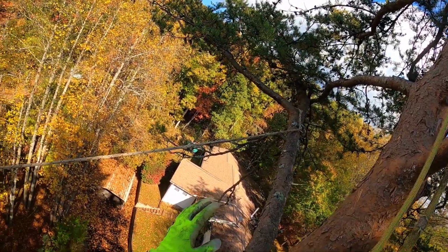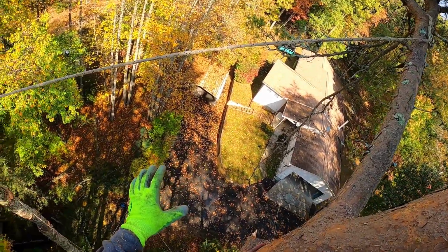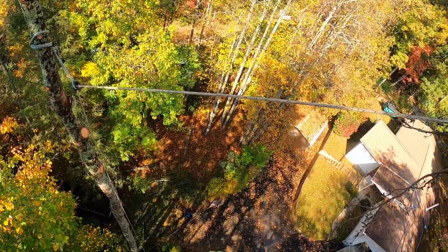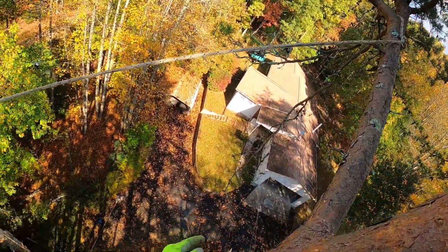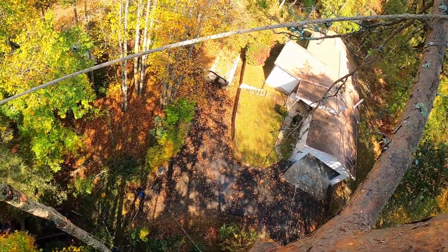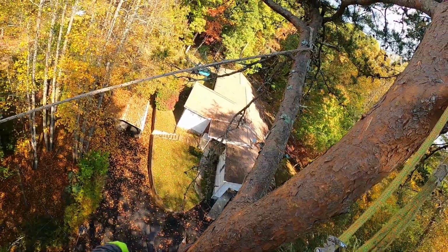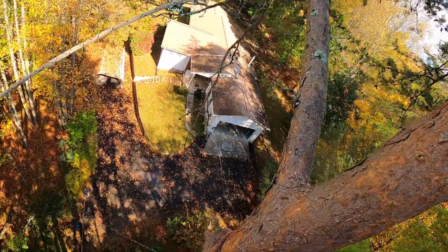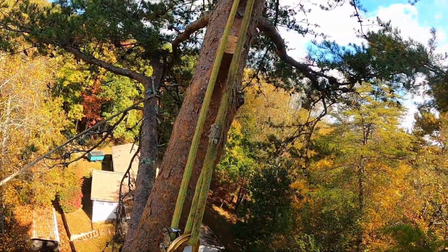Alright, with this one I'm going to let it hang just because you've got more slack here, and by the time it reaches there it's probably going to barely brush those wires, so we've got to take that into account. So what I'm going to do is just leave it hanging. That way it's hanging directly past the line a little bit, and then I'll cut the rest of it off, and that way it swings there. Because if I just cut the whole thing, it could do that, but you know, just another way. And lower your flip line here, that way it doesn't grab you.